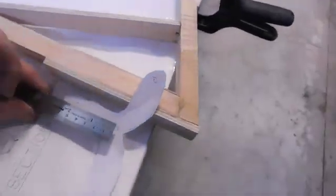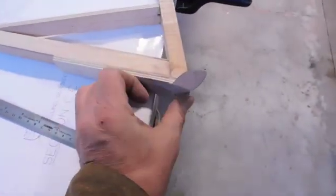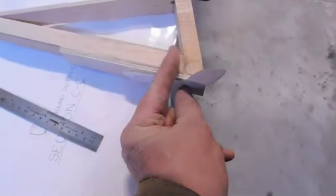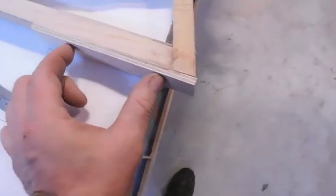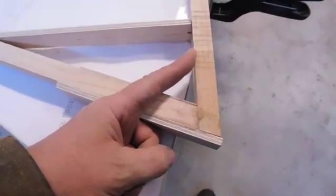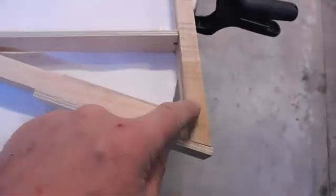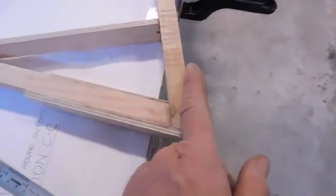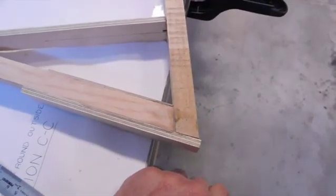Right now that's only two inches apart, so I'm going to go to three inches and build that up so it sits on there just right. That one screw is so close right to that joint that it worries me. That's why I'm lengthening that a little bit - to get the pressure off of that butt joint. It wouldn't be bad to add another corner block in there, but that's right where the hinge goes, and the hinge does come through. The hinge is two inches, so it's an inch, and this is only three quarters, so it hangs out a little bit. You have to account for that as well.